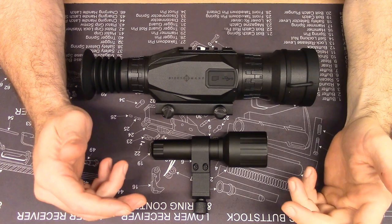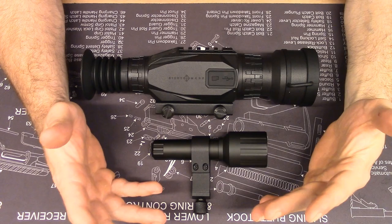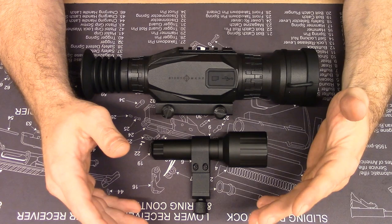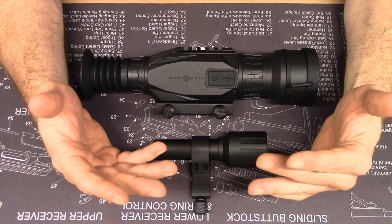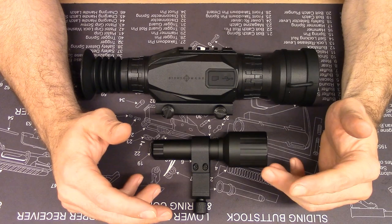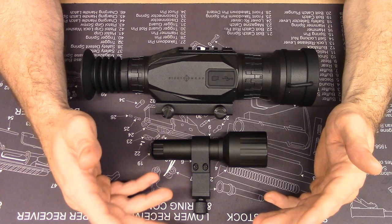Very briefly, I want to explain how digital night vision works. Where a typical digital camera would gather and interpret light in the visual spectrum with its sensor and then display that information on a screen, they usually have an IR filter inside — a piece of glass or plastic coated so that IR light bounces off and visible light goes through. This is done so the image processing doesn't have to deal with extra wavelengths of light. Pretty much all digital cameras can see IR or infrared light. Digital night vision uses a supplementary beam of IR light to illuminate your objective, and since the sensor doesn't have an IR filter in front of it, you can see all the reflected IR off your target, whether that be a deer, a hog, or whatever you're targeting.